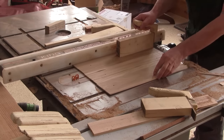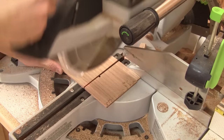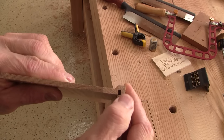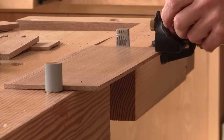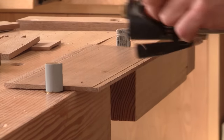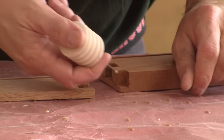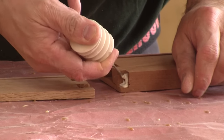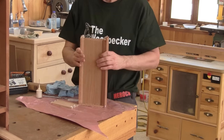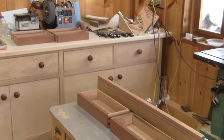Now I can cut my oak glue-up to the size of the drawer's bottom. I sanded the bottom thinner, but not thin enough. I have to make a rabbet all around my new bottoms. After checking that it's okay with a dry fit, I can glue it. I take care not to glue the bottom to the sides. When all the pieces are in place, I check for squareness and leave that to dry. I repeat the same thing for all the drawers.